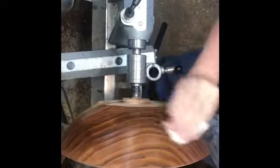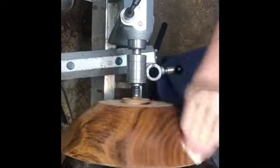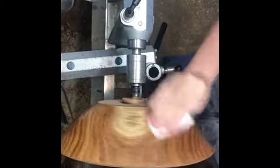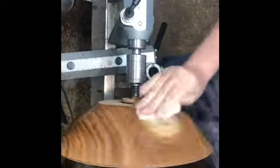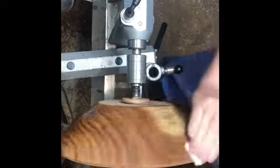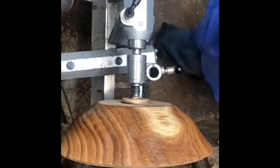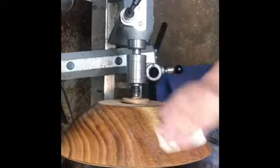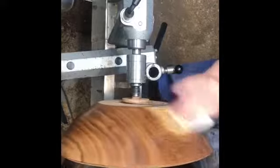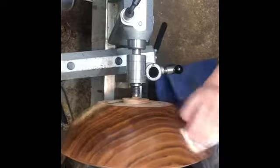Beeswax is a very soft wax. A lot of people use it. It's not a particularly good finish because it is so soft. Mineral oil cuts both of those and helps them to mix together. The beeswax will actually soak into the wood a little more than the carnauba will. Most all your car polishes are carnauba wax because it is so hard, very resistant to touching, to weather, water spots. Usually it has to have something mixed in it for the water spot business.